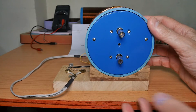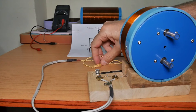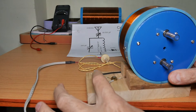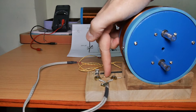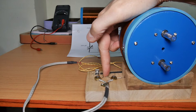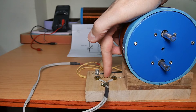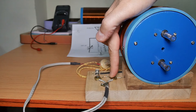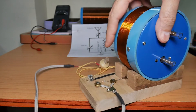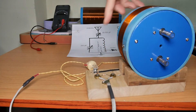So the plastic knobs are in place — some fancier knobs would be better, obviously. Continuing around on the front side, I've got the earphone, and I've put an extender on it which is why the wire is a different color. I've got a strain reliever and the two connections. One of the modifications is you need a resistor here instead of a capacitor — the old earphones required a capacitor, but the new piezoelectric earphones have a lot of capacitance built in, so you need a resistor here. This one is 50k ohms. I've got my brass washers to hold down the earphone connections. You can see back in here the diode, and then back here is the ground.